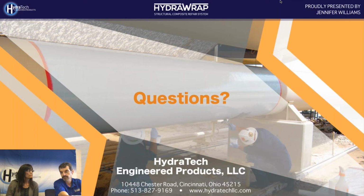Typically they're wet when it rains, and when the crews go out to a water valve, they will either have to pump all the water back out of that. We have other methods, better methods for trying to seal it to where it doesn't leak in, but there's a lot of old stuff out there that leaks. Metropolitan Water District encapsulates all their valves above the base in concrete, and so every time you go to get back in there, you have to chip all that concrete away beforehand before you can go inside the pipe to use the Hydrotite seals to repair the pipelines, and then you have to cover it back up with concrete again.